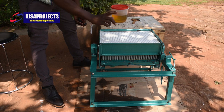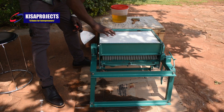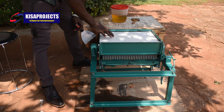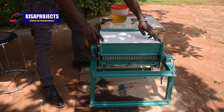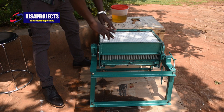After 10 minutes, check by using your hands — touch some of the samples to confirm that your chalk is strong. If it's not strong, you can prolong the waiting duration. However, we believe that by 10 minutes your chalk will be strong and firm inside the mold cavities.